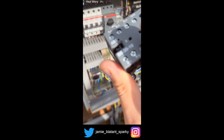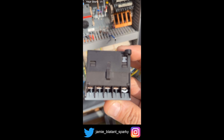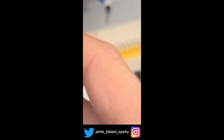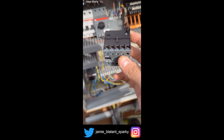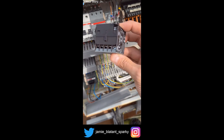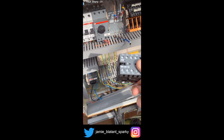You can move it with a screwdriver and obviously energise the core mechanically — but that's all chewed up, so I knew someone was bodging it. Then when I had a good look at it I realised: that's a 24-volt contactor. That's a 240-volt supply. That is just blowing this up. Someone has chosen the wrong contactor, so this has never worked. You come across this a lot — it's never, ever worked. Because a 24-volt contactor will not work with 240 volts, so why it's in there is anyone's guess.